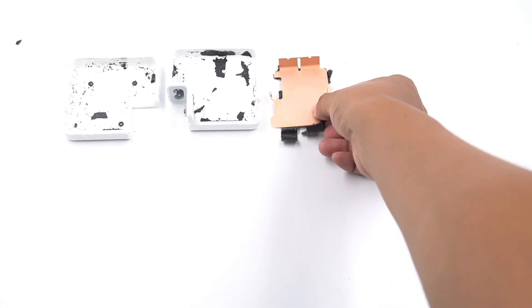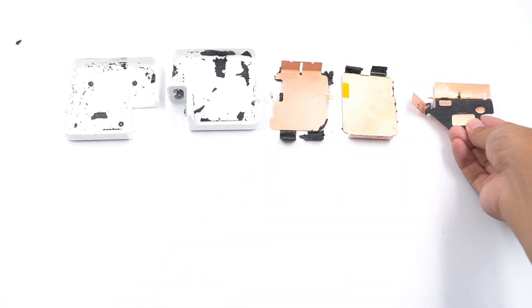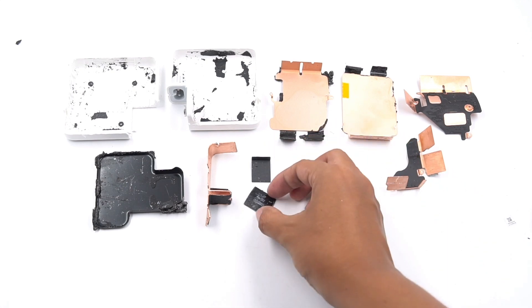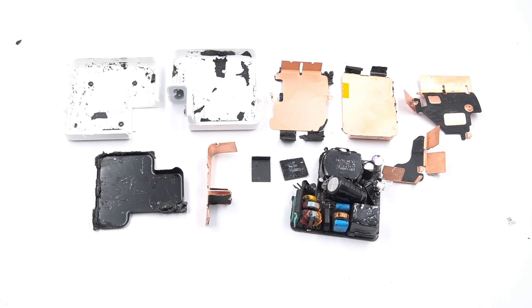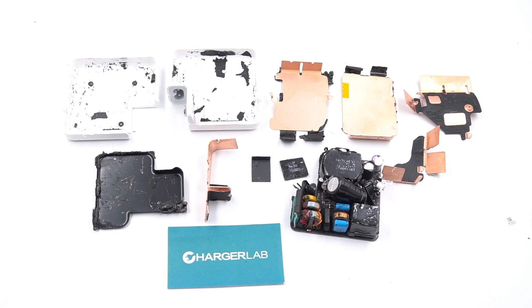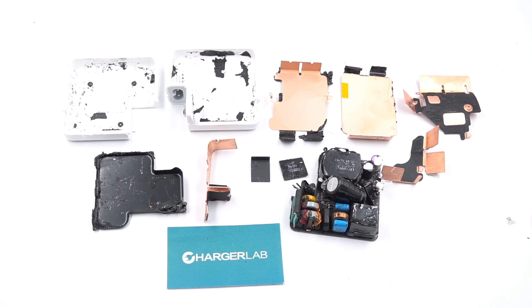After seeing all the components of Apple's 96W adapter, the materials are truly exquisite. The capacitors have high quality, high reliability, and long life, coming from well-known suppliers such as Rubicon, Nichicon, and Panasonic. The main internal chips also come from well-known international brands. For heat dissipation, a large amount of black silicone and metal heat sinks are used, making components very solid and improving thermal performance. So after seeing the teardown, do you think it's worth US$79? Leave your comments below. If this video helped you, please like and subscribe. See you soon!